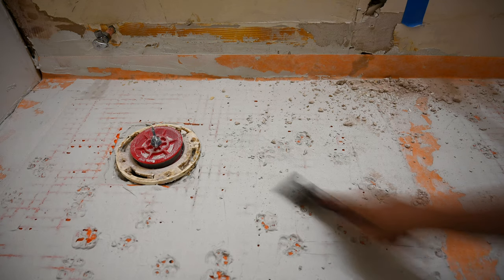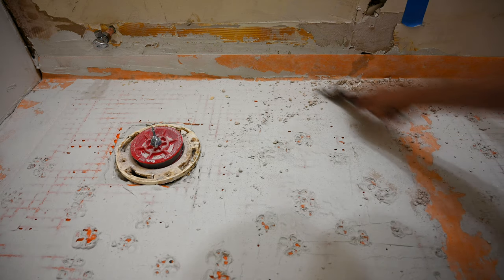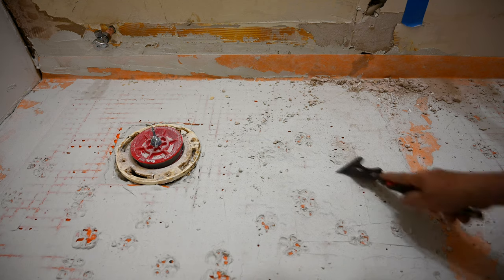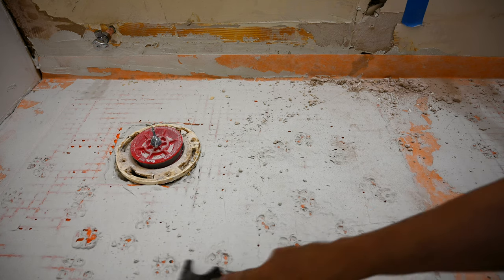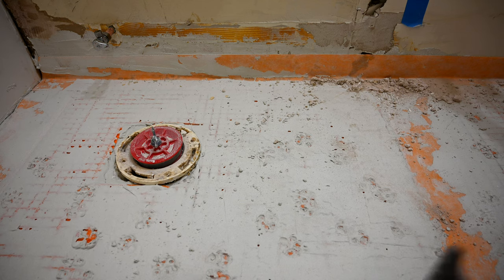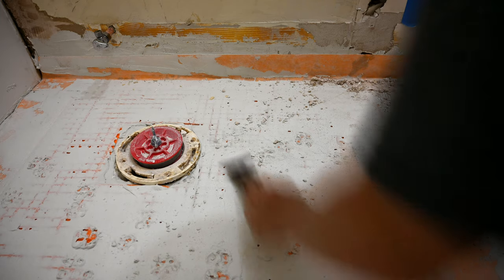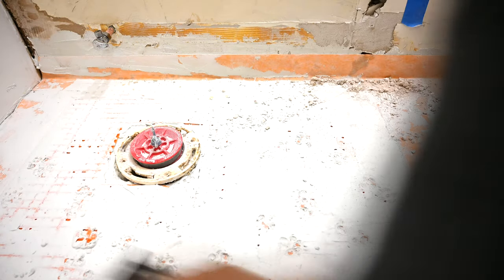One small step for dog. So now these footprints are everywhere, all over the DITRA. And what are you going to do? Well, you just use a scraper to scrape down all of the high points. We didn't lose too much time — maybe a half hour total — because we did have to go around the whole floor and scrape all of them up, re-vacuum, scrape again, and vacuum again. But we did eventually get it all grinded down nice and smooth. And then just before you're ready to tile, when you come in with your thin set mortar and start keying it into the floor, that will fill in all of these little gaps. So it really won't be a problem in the end — it's basically a non-issue.